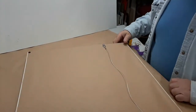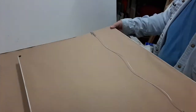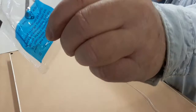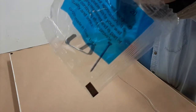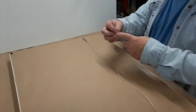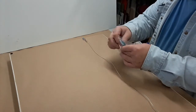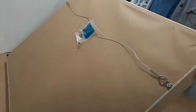Here it is all done — the back is all wired and ready to go. We use a hook to pound into the wall to hang it up with. The secret to the hook is that the nail goes down at an angle and it kind of pinches the sheetrock, so you don't have to be into a stud. On this one it's so small that one hook would be fine, though if you wanted to use two that would keep it from swinging on the wall.